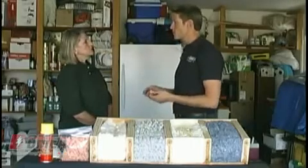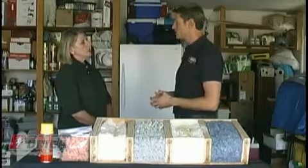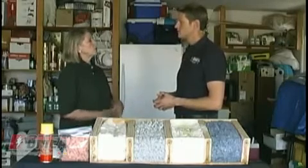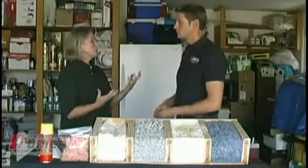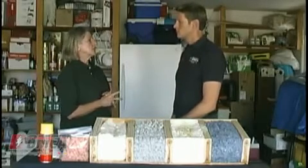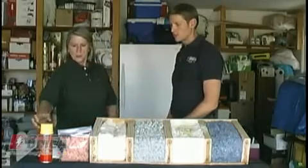So you want to be up there looking for plumbing penetrations or electrical penetrations, things like that? Right. That would also include knee walls. It would include chimney chases or wall chases or recessed cans that aren't IC rated. Okay, so any of those. And what do we recommend? I know you've got a product here to seal them up.